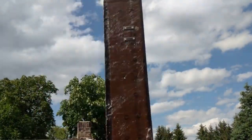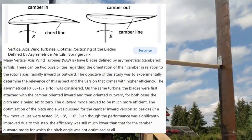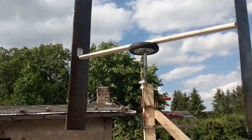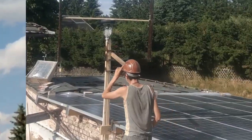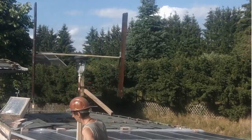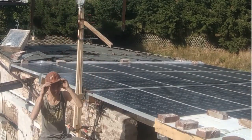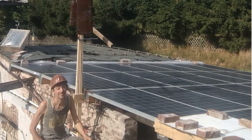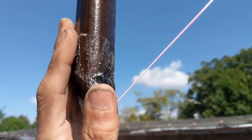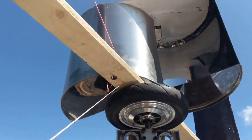The curvature is to the outside. I found some science publications. Now we have a bit more wind, so now it at least continues to spin. You see the angle is a bit pointing to the outside because it's mounted not in the middle. So if it would be in the middle at a 90 degree angle, then the backside would be outside of the rotating circle, so it's okay to turn it a bit. Also the lift should be more pointing forward. I added here the Savonius.